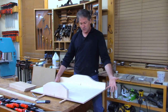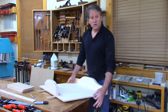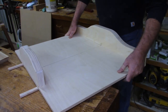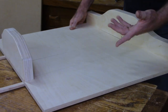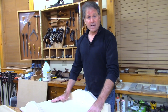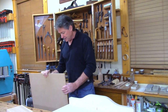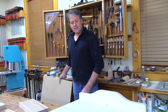We don't need to spend a lot of money on materials. The main table itself I like to use half-inch material because it's thick enough, works well under a lot of different materials, stays relatively flat, and you don't lose a lot of depth of cut. Baltic birch plywood at half-inch is solid feeling, but at half-inch thickness it can go slightly out of flat. So I actually prefer to use MDF - lightweight half-inch MDF is lighter than Baltic birch, so for a large sled it's nicer, and it stays really flat.